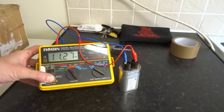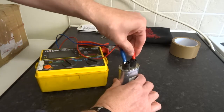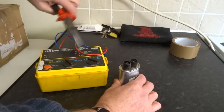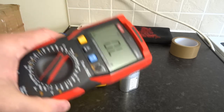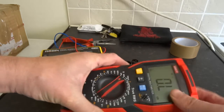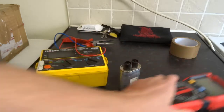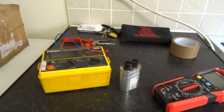This automatically discharges it, but it's best to check again. It puts in 500 volts. So there you go — you can test capacitors three ways: capacitance mode, ohms mode set to the highest setting, and an insulation resistance tester putting 500 volts in and watching it soak up slowly.